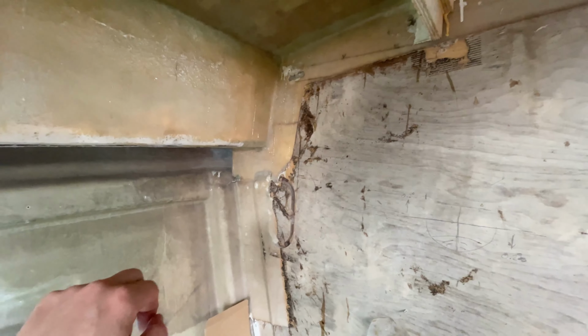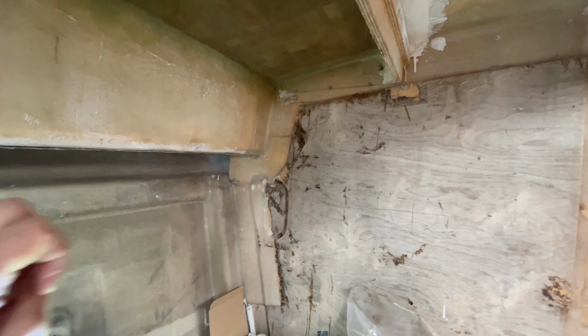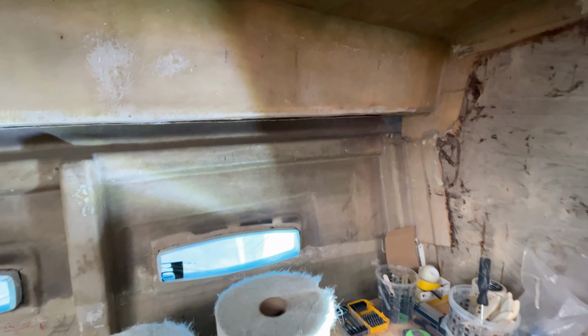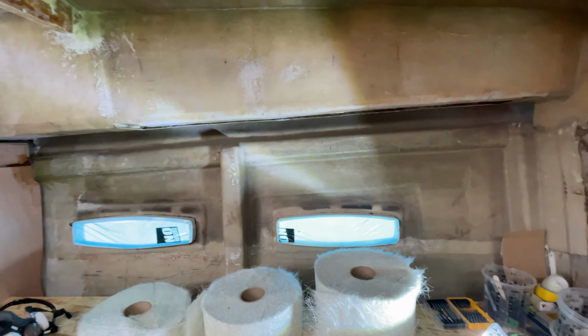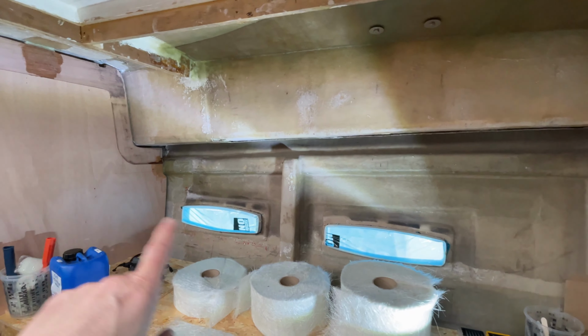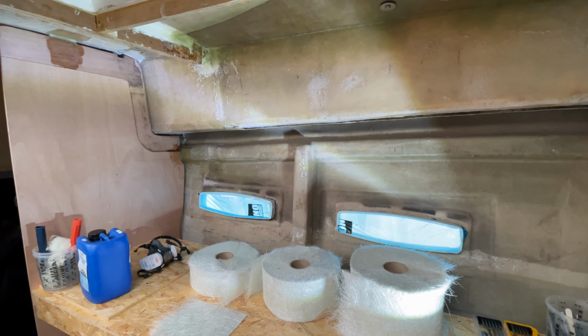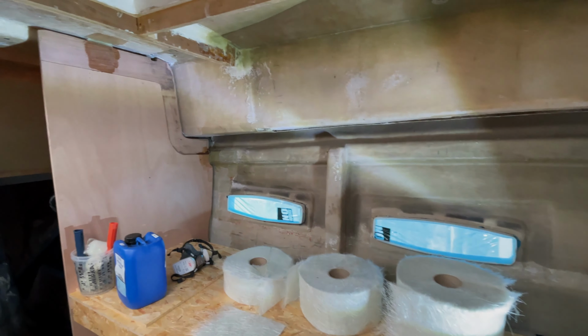I know there's lots of debate online about using epoxy and using different types of fiberglass, but we're just going to follow what the original Sealine factory did. This whole boat hull is actually laid up in chop strand mat. In fact, I'll put a link in the description to a video of this exact same hull being laid up with a chopper gun. So we're going to follow that. We've had a chat with the structural engineer and he's also fine with that. So yeah, let's get all this glassed into place.